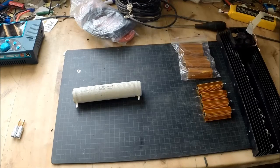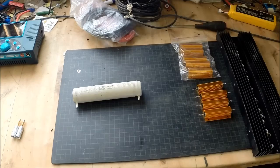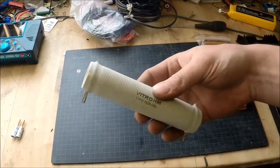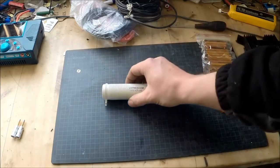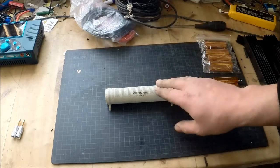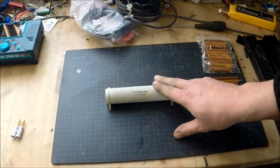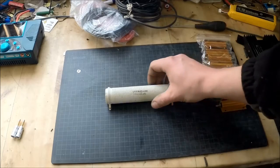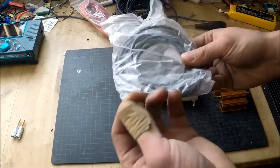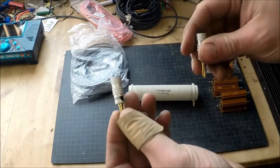Build it up on a flange like this one with some fans. I have a couple of fans to attach. But today I am going to build a bigger unit and I will be using resistors like this one. They are 5 ohm and I have 5 of those, so I will be connecting them in parallel - that means we will have 1 ohm total. They can easily handle 100 watts each without getting too warm, and I am going to use a fan anyway. To connect this up you need decent thick cables and plugs that can withstand this kind of power.